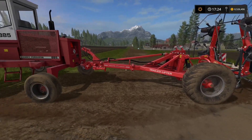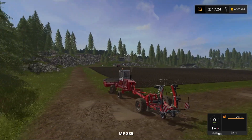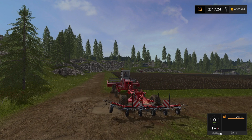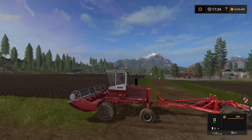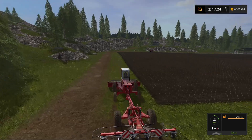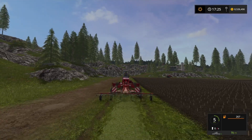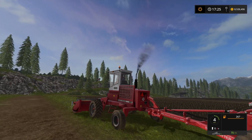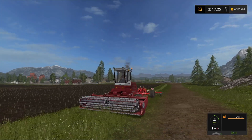This is a heavy bit of machinery — the whole section. On the back of the Big Bud it makes no difference whatsoever. Let's start it up. Go to the back unit, open up the tedder, turn it on. Switch to the front, turn it on and drop it down. This will only go about four to five miles an hour now because it's got quite a weight on the back. However, it will still cut, still leave a neat windrow, and with the tedder on the back it will ted it and leave a relatively neat windrow — spreading it a little bit from the original. The original grass windrow is quite narrow; the hay one, because it's gone through the tedder, is a little bit wider. But it does work.